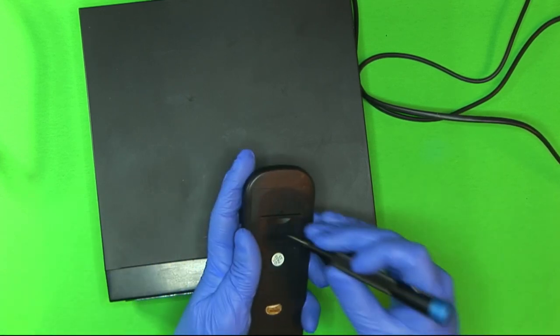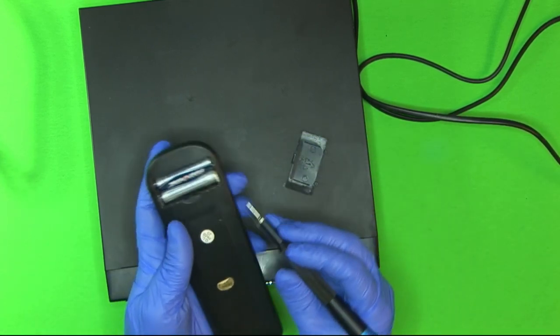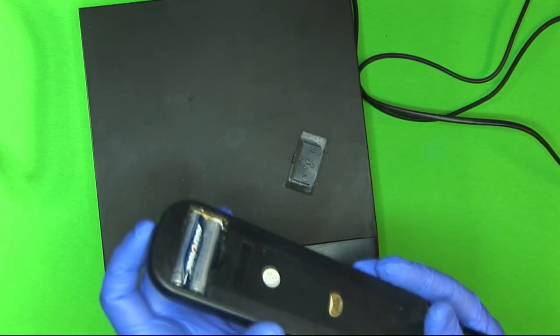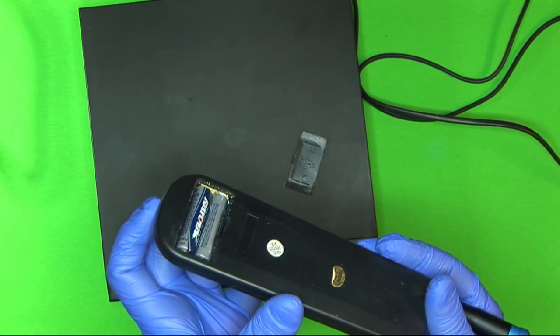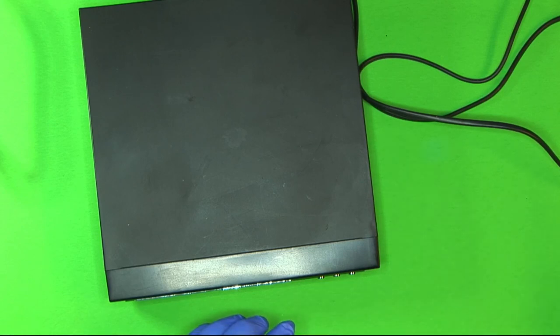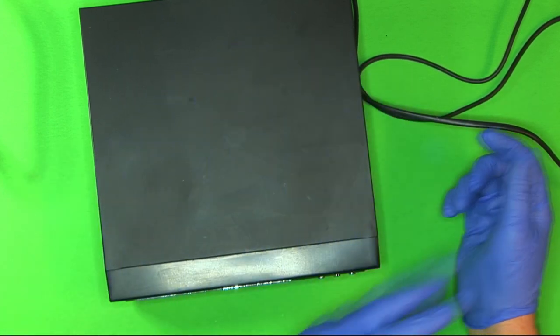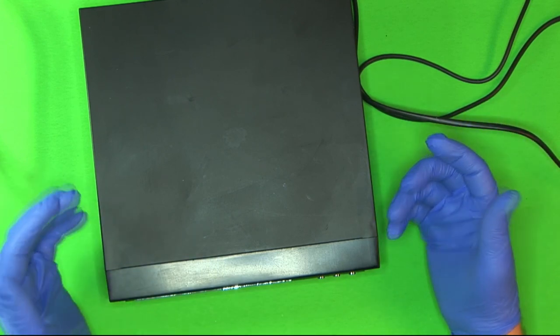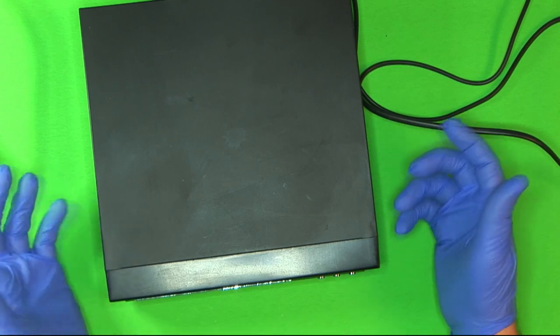The remote — I was going to use it, but the batteries are leaking, so I'll have to deal with that. The remote does not work with those batteries, but once that's cleaned out I assume it'll work just fine. This one, like I said, disc skips if it'll even load a disc. Sometimes it says it's a bad disc — I've tried multiple. This is common on a lot of DVD players, so if you have this problem maybe this video will help you.